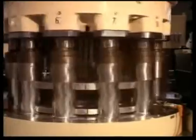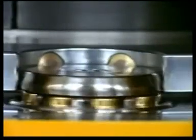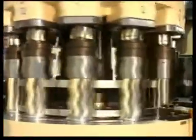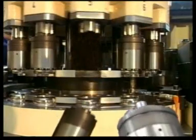In the spin flanging module, the upper and lower flanging heads perform a lifting movement. 2 counter-rotating die heads fitted with driven or idle flanging rollers produce the rims on the can ends. This careful forming process is especially suitable for thin and hard material. Changing the complete flanging heads is quick and easy.